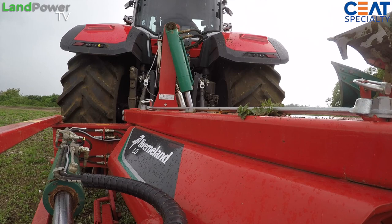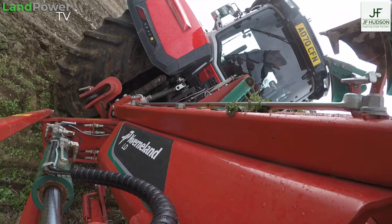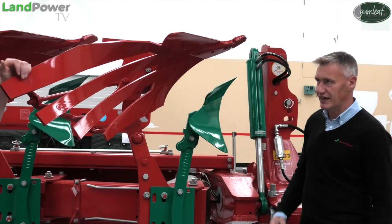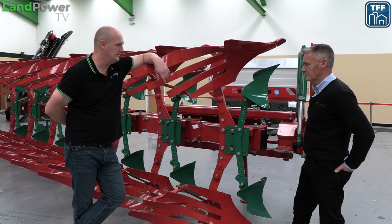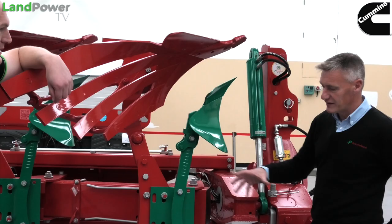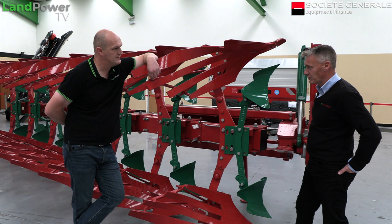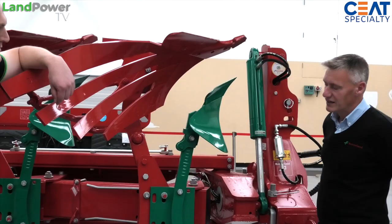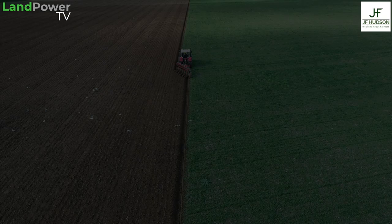It comes back to what we were talking about earlier regarding tractor horsepower - we're getting bigger and bigger tractors on the front of them. The frame strengthening kit is not really there to strengthen the frame - the frame itself is more than strong enough. It's literally there to stiffen the frame so we don't get any bow, to control the furrows a little bit better. When it comes to the bodies, our number 30 body comes with twin stays because of its framework assembly. But on our number 28 body and number 38 body, because of the horsepower this plow is going to be on, we now have twin stays on both of those bodies too, to give a little more rigidity in heavier soils when plowing deeper.